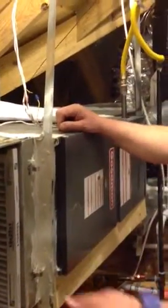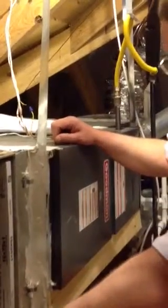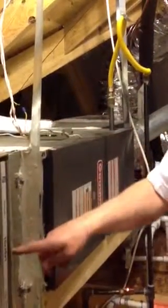He listed that on your inspection too. The big one goes into that compartment here — same location. There's a one-inch size and a four-inch size. So this is your 16 by 25, and that one over on the right side of the unit is your 20 by 25. So there are two filters to change — one for upstairs and one for downstairs.